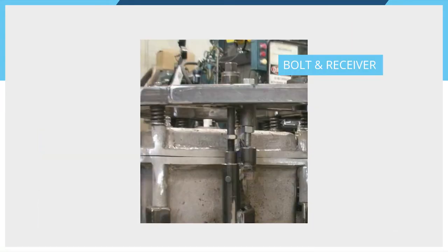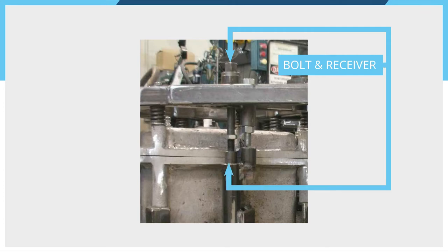Here's another option: bolts and receivers. You can see that the top half of the mould is set in a frame which contains bolts that can be tightened quickly with an air wrench. The bottom half of the mould is also in a frame and has screwed tubes fitted, positioned to receive the bolts. Sometimes flanges are drilled and fixed simply with nuts and bolts — this is a cheap alternative, but very slow to undo during demoulding.